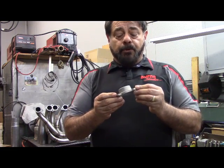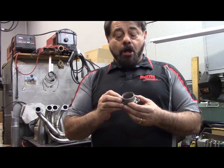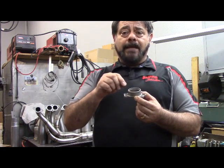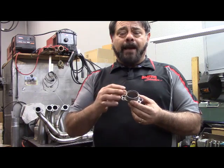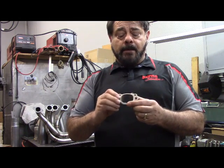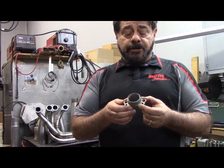What's coming into vogue today is actually 3D printing. This is a 3D printed flange done with a laser sintering process — from a CAD model to a part in a day. It's pretty amazing technology. The other process is called Metal X by Mark Forged, which is a powder metallurgy process where they print much like a plastic printer would, and then the part is taken and put in a sintering oven, which bakes off a binder and consolidates the material, giving you almost the complete strength of 304 stainless steel. What's also very interesting is they're able to put honeycomb on the inside of the part, so not only do you have a dimensionally good strong part, it's also lighter because parts of the inside are hollow. That's the technology that's come to market here in the past year — a very, very good one.